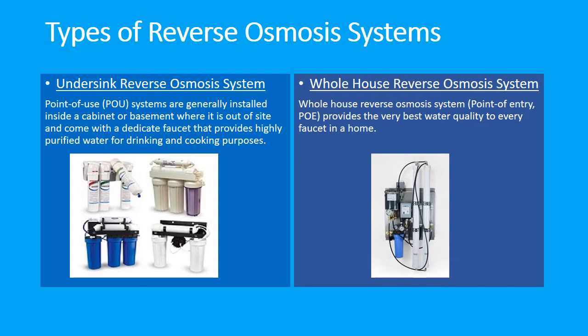The size of these membranes can be 2.5 inch by 40 inch, producing 700 GPD or 0.5 GPM, or 4 inch by 40 inch, producing 1400 GPD or 1 GPM. A typical whole house reverse osmosis membrane system contains 1 or 2 membranes. The actual water production is dependent upon many variables.